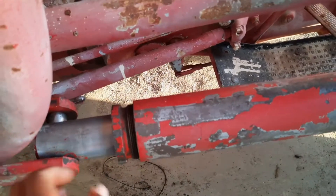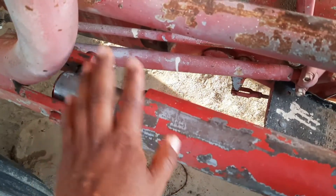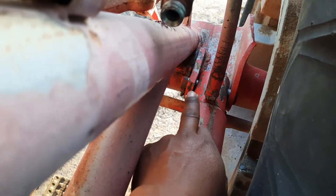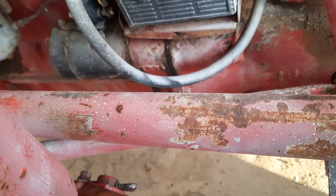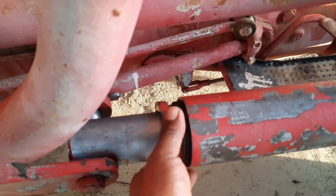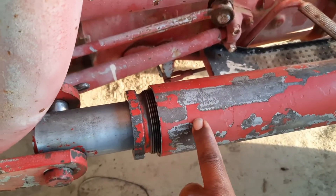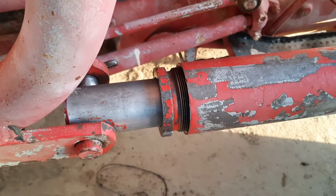I removed the cylinder because I wanted to take it to a local shop to find the right parts and get educated on what I have. I removed the hose, removed the pin over there, then removed the cotter pin — it's a half-inch, pretty easy to remove. Then before I even removed it, I removed the cap, which was already very loose, and then there's what they call the v-packing around here — you'll need a good set of picks to pull it out, but they came out fairly easy.